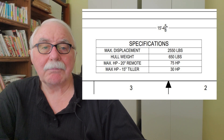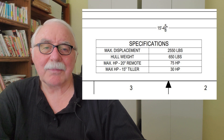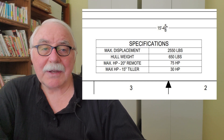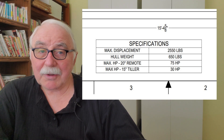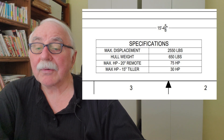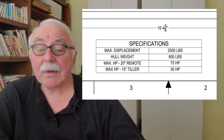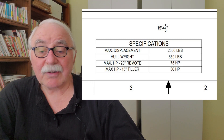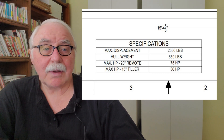That is my recommended maximum load for this boat. Can you exceed it? Yeah, you can — I wouldn't, as it's what I've determined is the maximum for safety. But it can be done and is done sometimes. The boat will sink down in the water more if you add more weight. The maximum displacement is made up of the boat weight, which depends on the weight and sizes of material you use, the number of layers of glass, and the engine weight.